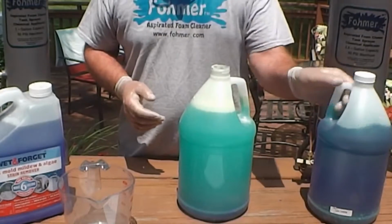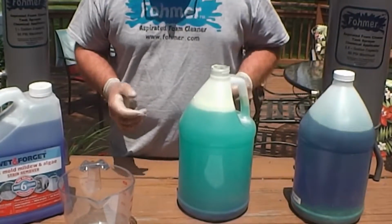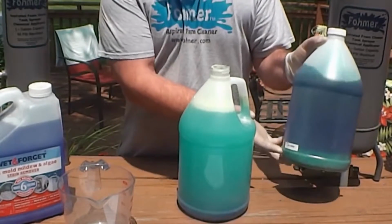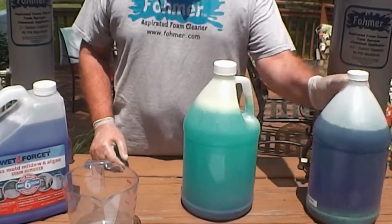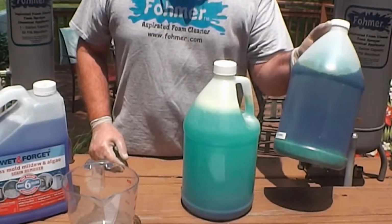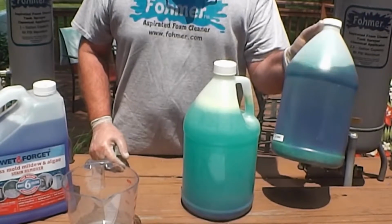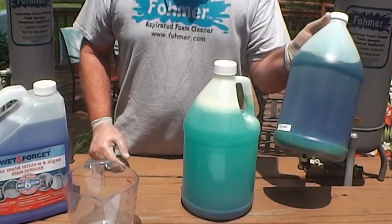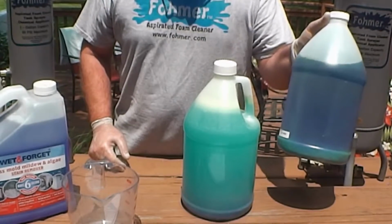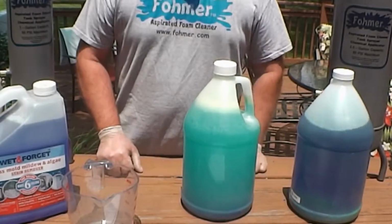Don't worry if there's still crystals on the bottom of the jug. You want that. That just means the copper sulfate is saturated. As long as there are crystals on the bottom, the liquid is saturated at around 20%. And you can see there are plenty of crystals on the bottom of this jug. When I use a little of this, I'll put more water back in until all the crystals are dissolved. And when that happens, I'll add more crystals. That way I'll always have a gallon of 20% copper sulfate liquid to use. That's all there is to making the copper sulfate.